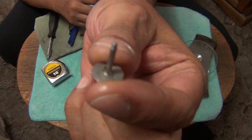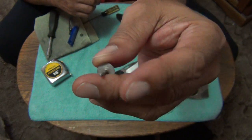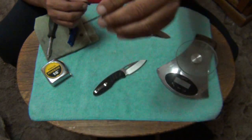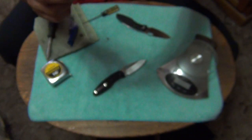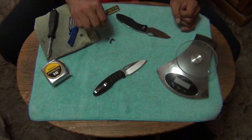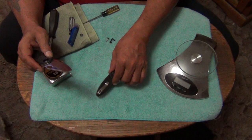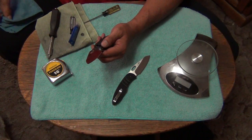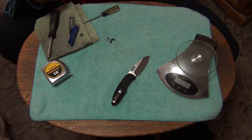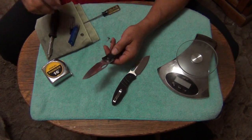I think this piece needs to be a little bit more stout too. Instead of a T8, make it a T9 and just have a little bit more diameter to it and maybe even a couple more threads. Make this piece a little bit more stout so it can thread in a little bit longer. With a little bit of red Loctite on it, it won't come loose. That's the only issues I have found with the deadbolts when you use them a lot like I do.